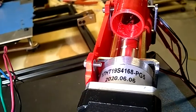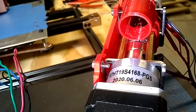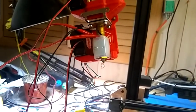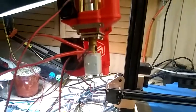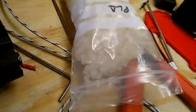The head smells a little funny as it heats up, but who knows if that'll go away with time. The first little bit of PLA is coming out of the head. I heated it up a little past normal temperature — it's at 230 right now. I figured this heated block is bigger and needs more heat. I filled about a fifth of the bag and need to load some more into the hopper.